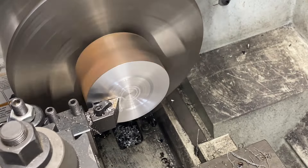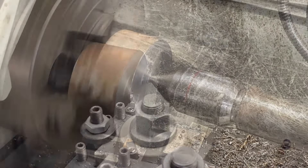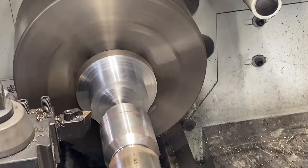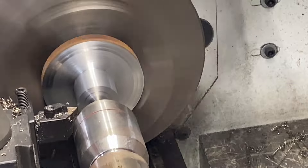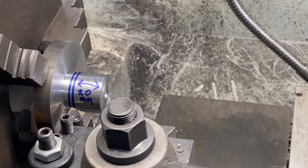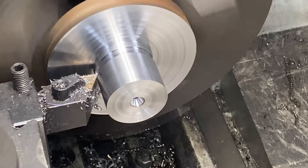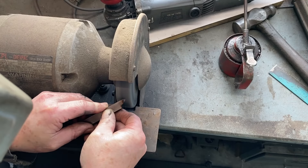I clean up the faces in the lathe and put a center in the end because it's not held in the lathe by very much. Then I start turning down the outside and I need to get this down to around 32 millimeters — so there are quite a few passes with a lot of material to take off. That measured up great. The thread itself is around 20 millimeters long and I've drawn two lines — that's going to be a little gutter for the threading tool to run into. I turn that little gutter out and down to the proper depth. We are almost ready for threading.